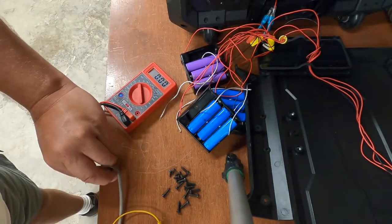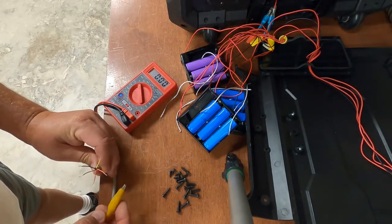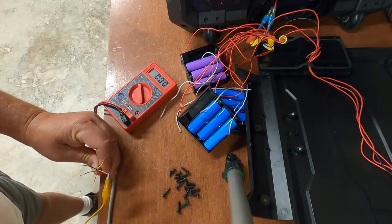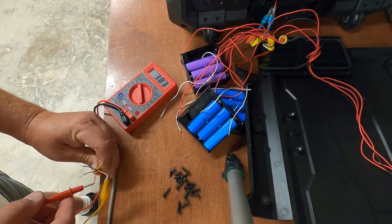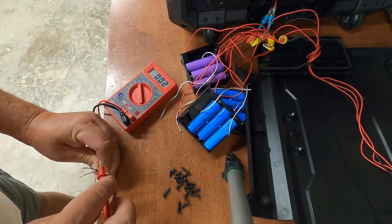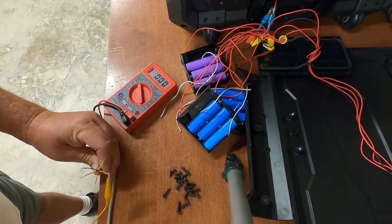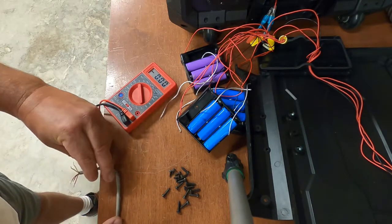Alright, I'm gonna try to show you the goods. So everything's hooked up now that I changed around the plug so that all the wires are in the right places. Orange is negative. So this is how I'll have to wire it to the battery charger. Anyway, there's bank one, which is 3.7 volts. Brown isn't used. Black is 7.6. Yellow is your 11 point whatever. So that's it. And it shows there's three banks, which would be a four wire system for wiring up that smart charger. I'll get that going next.